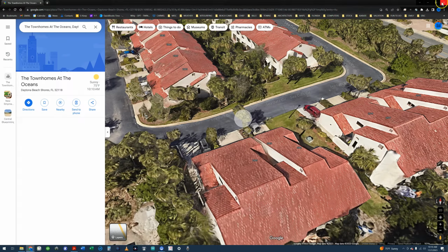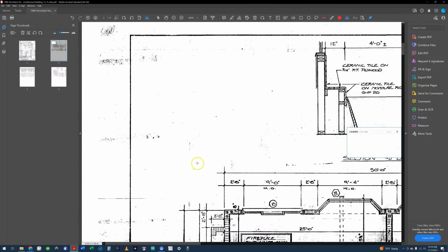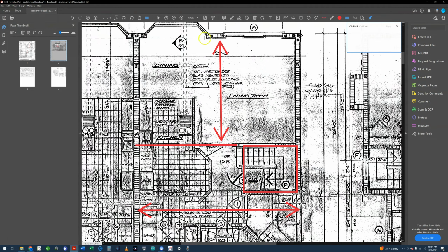The way I see it, looking at the drawings, they have floor joists going rear to intermediary, which is the wall. Let me see if I can get this over for you. Okay, so floor joist going from rear wall to a beam right here that bears on this partial wall that comes off of the staircase.